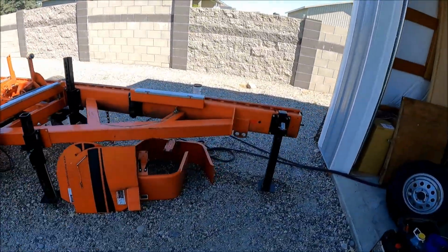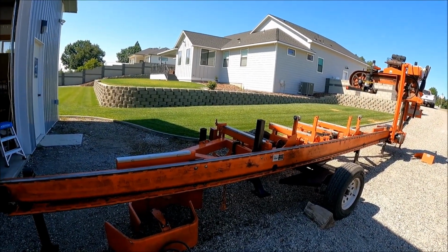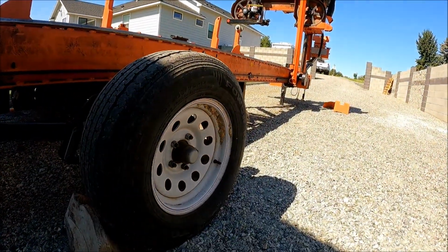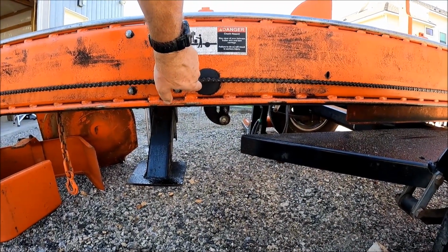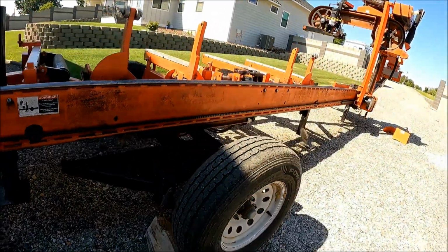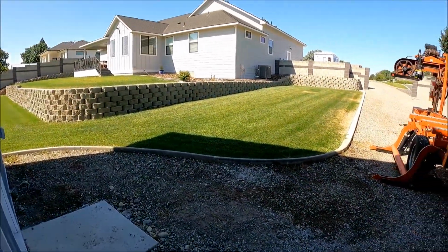All right, so I'll get the hydraulics checked. The other thing I was looking at is my chain. What they say is that the chain should run about halfway along this guy here. It's a little bit low, maybe. It's halfway on the marker light. And that looks like it could come up about a quarter of an inch, maybe just a little bit tighter. So probably a good idea. That bottom rail didn't look real pretty, but it's working. Get that done, and I also might swap the tires. They seem to be wearing a little bit odd, so we'll see.